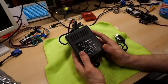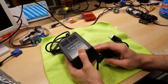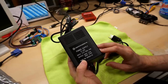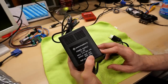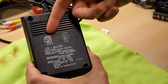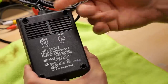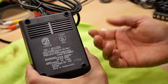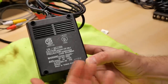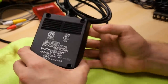Let's take a quick look at the power supply, which I have never seen one like this before. This is Commodore part number 902-503-02: 117 volts input, 5 volts DC output at 7.5 VA, and 9 volts AC at 9 VA output. On the bottom it has USI slash Billion CSA — the Canadian Safety Authority — and UL, Underwriter Laboratories listed. These are two agencies that certify safety for North American power systems. Made in Taiwan, and I think this is from the 47th week of 1982, which implies this machine was assembled and boxed around the end of 1982, just in time for Christmas.